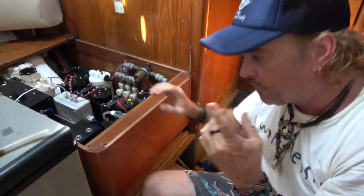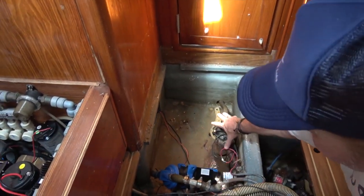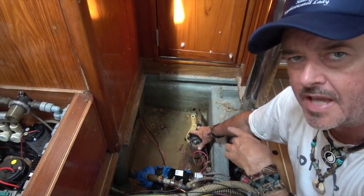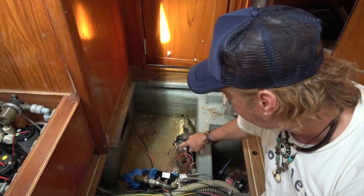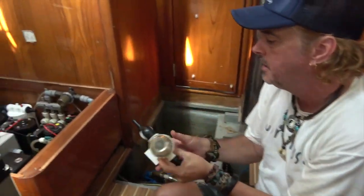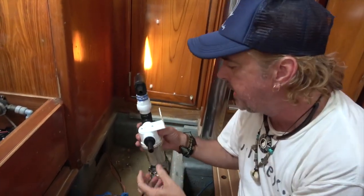The first thing we need is a saltwater feed. We're going under the floor because there's an intake right here — this was an old pressure pump used as a salt water wash-down on the bow. There was a garden hose in the anchor locker to rinse mud off the anchor as it came up, but it's been dead for years and we hardly ever used it anyway. Now I'm going to remove all of this, because the new system came with its own sea strainer, and I've planned for this new assembly to go below the floor right where that old pump was. Old tubing will be removed and a brand new piece will run straight into the new strainer.